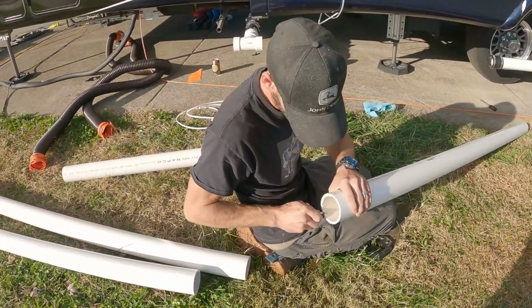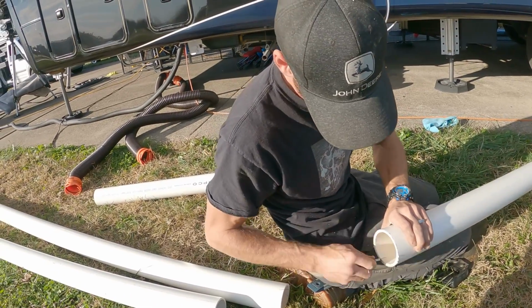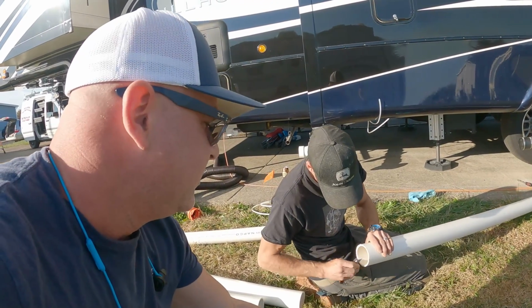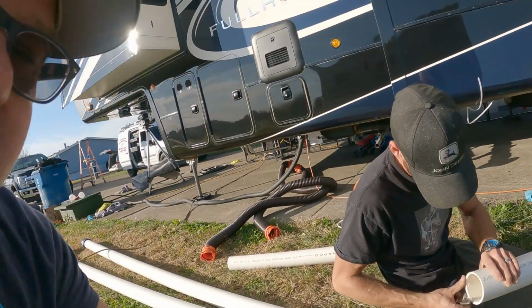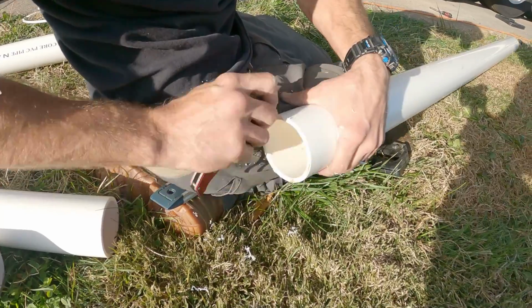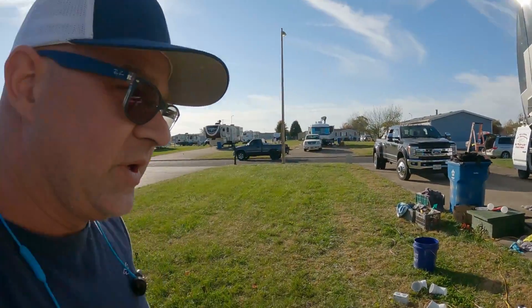Also, you were saying something about this, Derek? Oh, bevel the edges. Yeah, keep it from sticking. Makes it flow better, and so the glue doesn't squeegee off. In other words, as you put the pipe together, it squeezes out the glue. But he's beveling the edges so that doesn't happen. Inside and out. Inside edge and outside edge. So pretty cool.